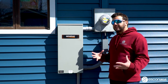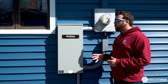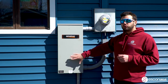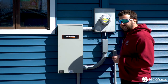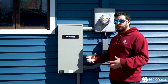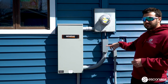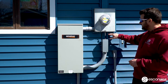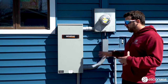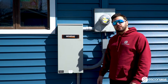A pro tip: if you guys are thinking about doing siding or renovating your home and getting a generator at the same time, you do want to have the generator — or if nothing else, the transfer switch — set before you do the rest of the siding or anything like that. When we as installers and electricians go to do installations, we end up having to reroute some of the existing work. In this case, the customer has some J-channel that he is going to have cleaned up with the siding, so just keep that in mind — we don't want to add to your plate as far as the installation goes.